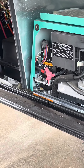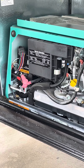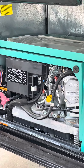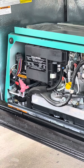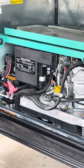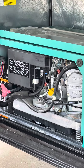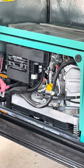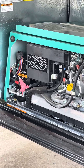You also have a built-in safety feature in your transfer switch. Whether power is coming in from shore power or the generator, it doesn't allow both to come in at the same time — it's built so it doesn't start a fire. However, I'm on the cautious side. I like to unplug first, then start it, let it run for a second and idle where it needs to, then turn everything on and you're good to go.